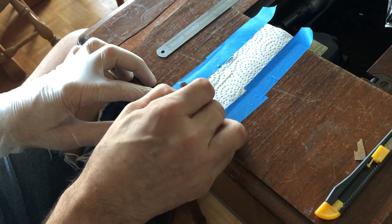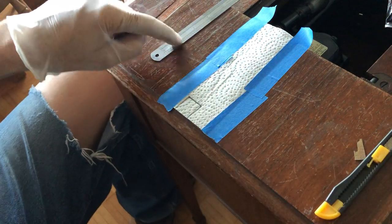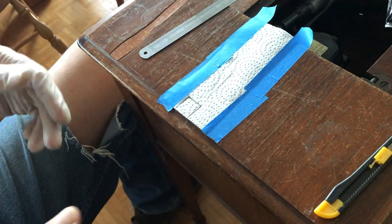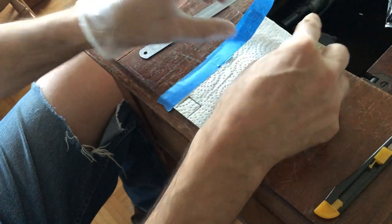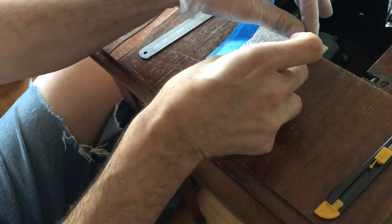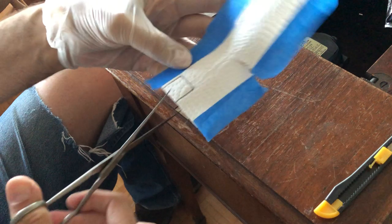This is a lot easier than the other one because I basically have mostly straight lines to push against. Now I'll go back with the pencil like I did before — I'm pushing down and I can tell where the higher level of veneer is for the old stuff that's staying, and that's where my little spot is. One of the keys is making sure that your straight edge — or if you have a plastic triangle like an old geometry triangle — you can use that too. I want to be really careful when I pull this up, coming from this side so I don't irritate the old veneers. Cutting this one out will be a lot easier and simpler.